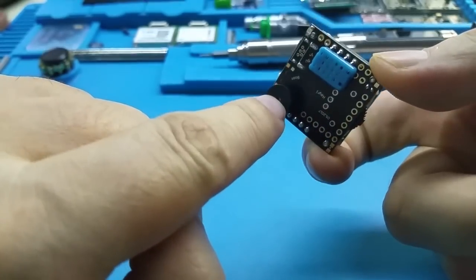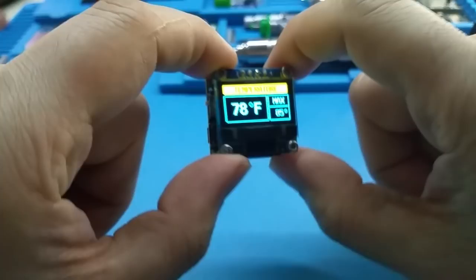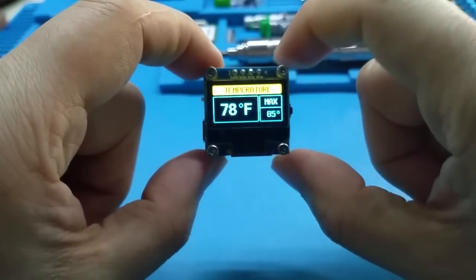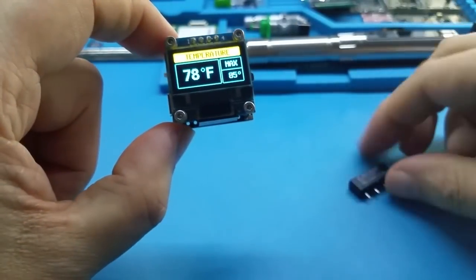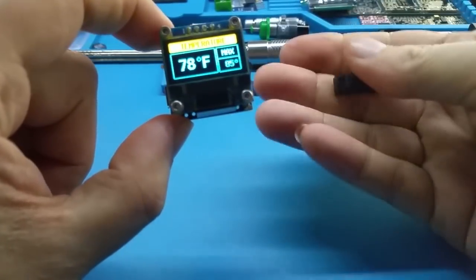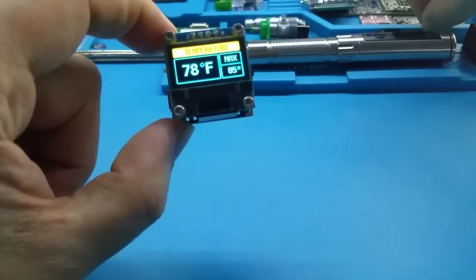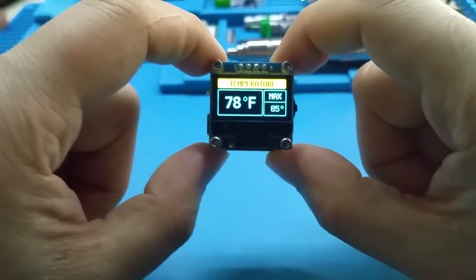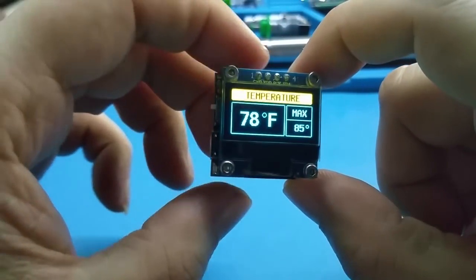It has an audio piezo buzzer, an LED, and a wire output for a relay. You can use a 5-volt reed relay, like this little one for example, or if you want to switch mains voltage you can use a solid state relay.